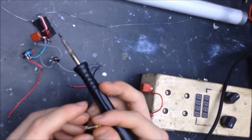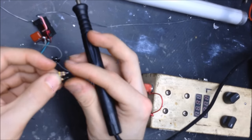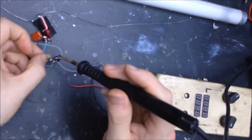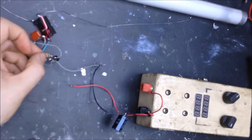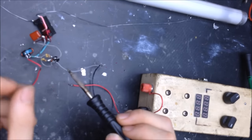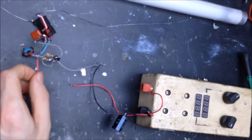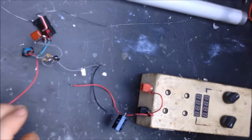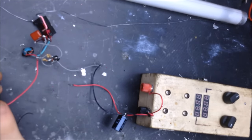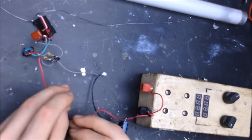So, these are the two 470 ohms, giving us 235 ohms to each, so about 1/4 of a kilo ohm now. So, half the resistance, which could either raise or lower the efficiency of the circuit. We'll tell by how much amperage is being drawn once it's connected. The reason why you wouldn't want to run such a low resistance on a higher voltage circuit is because the more volts you put in underneath a lower resistance ohm, the more wattage it consumes and the more heat it will create.